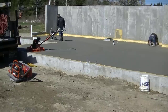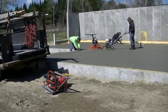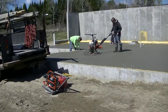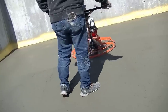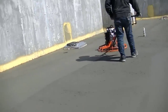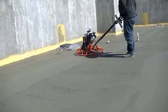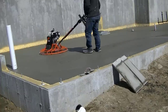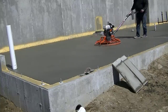Darren's still got his pouring boots on — this thing did set up pretty fast. We put accelerator in it, and it was right out in the sun with a little wind, so the concrete was drying pretty good. The concrete mix used warm water. On the first pass, he put float blades over the finish blades — we call this floating it. Darren's out there floating the concrete, and then Luke's going to lay it down with finish blades using the MBW power trowel. You can see how much smoother those finish blades leave it. The float blades are just for bringing up the paste, pushing down surface rocks, filling holes, cutting humps, and filling any low spots. Then the finish blades give you your final finish. We'll go over this probably three or four times before the floor is completely done.